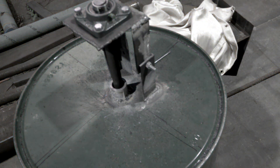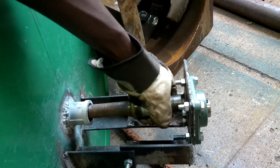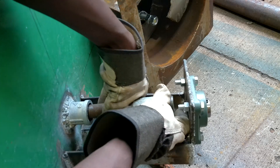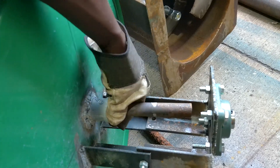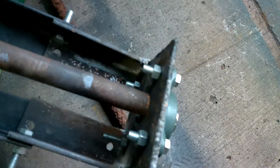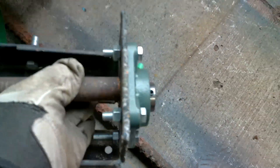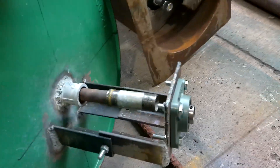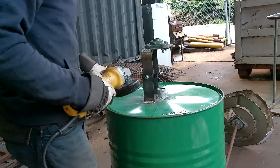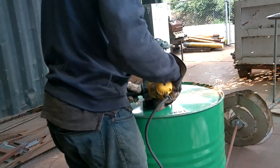From this point forward, everything just goes downhill. You would think everything would line up well, but the moment I go to put the actual auger blade in and not just the little shaft I had - as you see, it doesn't line up at all. I figured, okay, that's fair - I was not basing the measurements and dimensions off the auger blade. Obviously it sits in this reactor differently. I was just assuming everything would line up perfectly, but of course it didn't - because I'm imperfect. I didn't cut the auger blades perfectly, so they probably don't sit at a perfect 90 degrees.